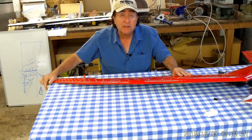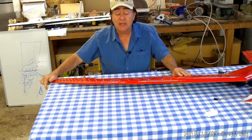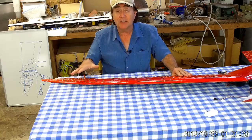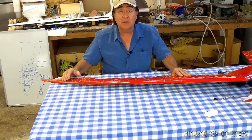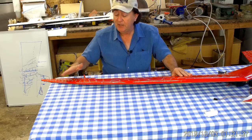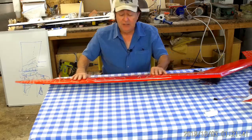I'm going to work with a straight taper and modify the twist pattern so that I can stay close to the elliptical lift distribution that the double taper approximates, yet without the double taper — so I don't have the aggravation of the spanwise flow problem, yet I maintain the performance.